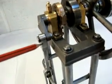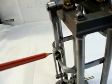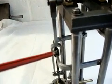The crank is connected to the connecting rod, which is a stirrup-shaped connecting rod, which passes astride that support arm, which carries a top bearing that supports the piston rod, which you can just see there. It's quite important that this support arm is made fairly accurately, because obviously everything's got to align here, as well as having a working clearance between the stirrup rod as it passes each side of that bearing support.